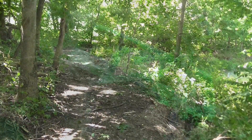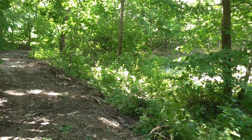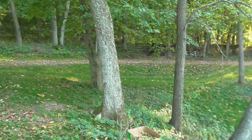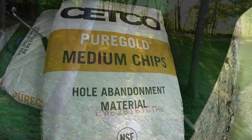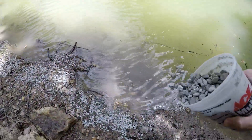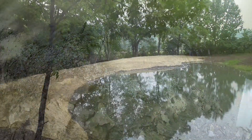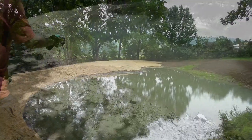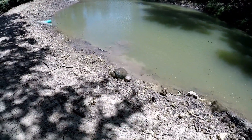I used the box blade and the backhoe to rough in a road around the pond, cutting it on the higher end — that turned out nice too. I don't know if this was a good idea or not, but I put some bentonite around the pond edge in hopes that when the water rose it would help seal some leaks.